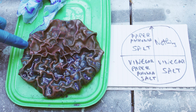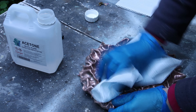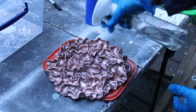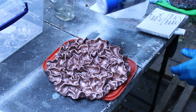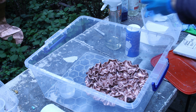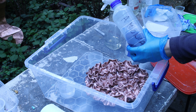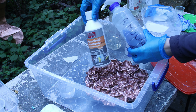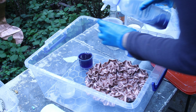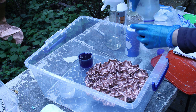So vinegar was the key ingredient. I took my main piece, cleaned it up with acetone, then used the key ingredient — vinegar — spraying it all over the piece and sprinkling some salt. I placed it onto a larger container and transferred a small container with ammonia in it — it looks blue because of the chemical reaction of leftover ammonia from a previous project, but it's literally just ammonia and I'd rather reuse it than dispose of it.